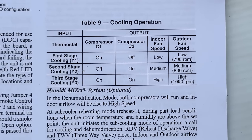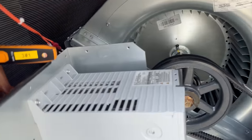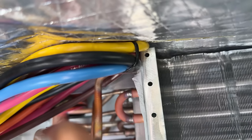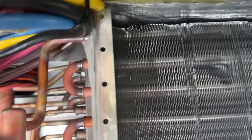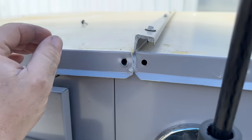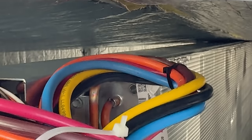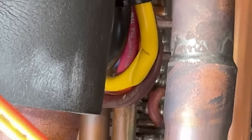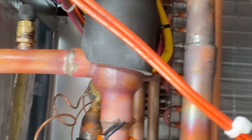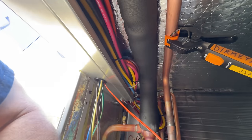The way it's supposed to happen — there's compressor contactor one, then compressor two, then both. We got it turned off. That wire right there is the compressor wire, and it's around that sharp edge. You can see it — it has thick insulation — but down there that's not puncture, it's just rust or rubbing. Got it out of there — that definitely would have tested the breakers' capabilities.